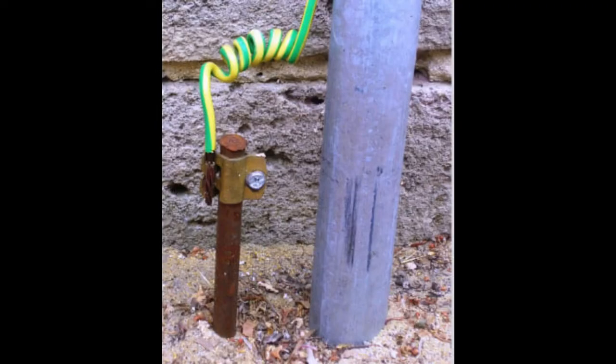Earthing system is the system that transfers the discharge of electrical energy directly to the ground, thus reducing the probability of shock or electrocution that may be caused to a human being. So earthing is a very important aspect of an electrical wiring system, be it for electrical appliances, power circuits or lighting circuits. Earthing is the heart of the electrical wiring for safety reasons. So it must be ensured that all the earthing connections have been made properly.